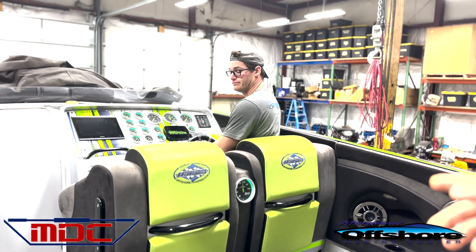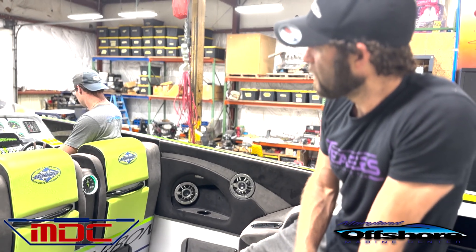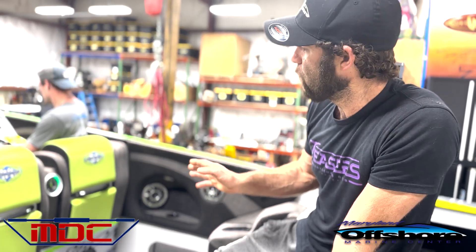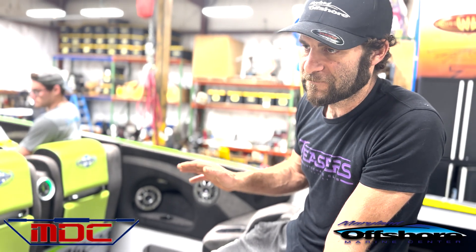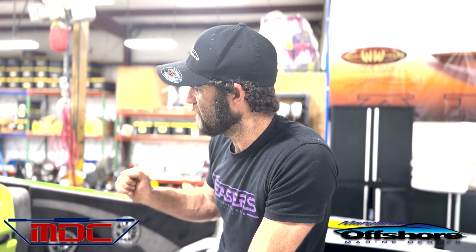I'm here with Brandon. He's going to be hitting the race switches and controls — basically trimming. He can trim the drive still individually, or he can trim it with the bow switch. If he hits the bow switch, that's what activates Drive Sync Race Edition. The race side of it is the two presets: one's going to be the neutral setting and one is a V-bottom setup. I set it up so when you hit race down, that's three degrees down — it's kind of like putting the brakes on the boat. You can bang it in and out between the neutral switch and the three-degrees-down switch. The boat will pick up in neutral; you'll see a wake or obstruction, drop down, boat flattens out, clear the obstruction, bang it again into neutral and you're back going again. So you're not having to work the trims and drives all the time. This thing's always going to keep the drive straighter than you could ever do manually.